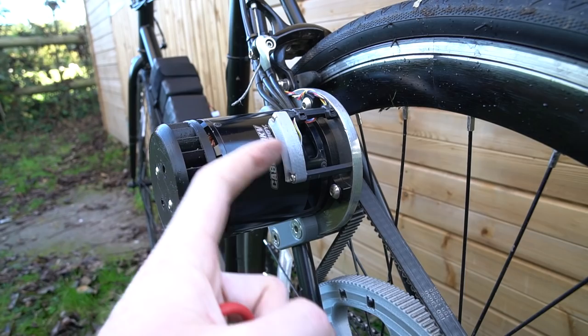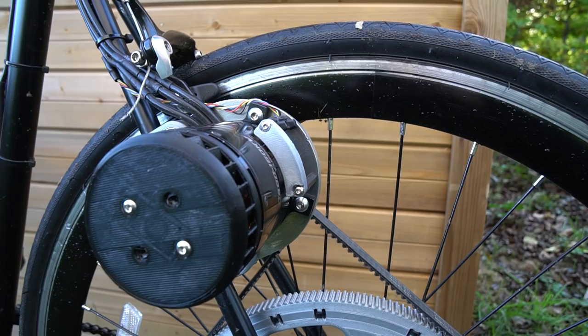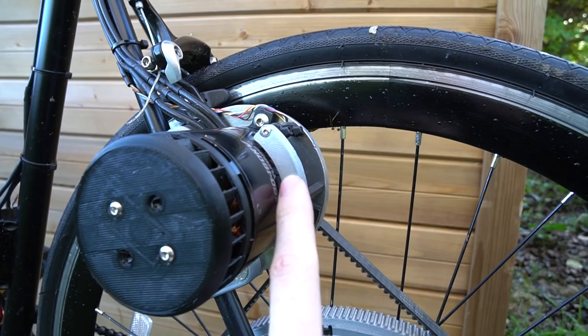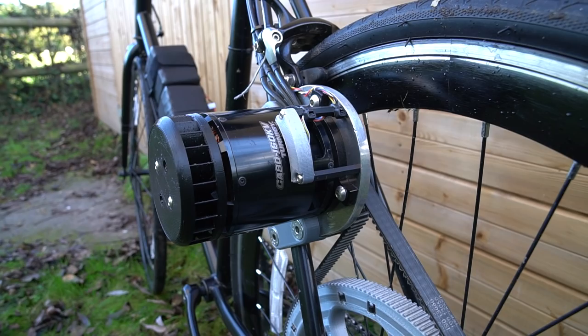You pretty much have to mount the sensors at a given angle around the motor. These sensors are at 17.14 degrees spacing - I think that's to do with how the magnetic poles work. They've really increased the low end torque, and I highly recommend them. It's a bit of a pain to solder them because they're a bit fiddly, but well worth it in the end.